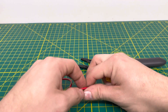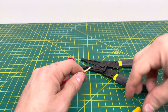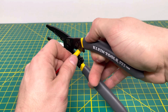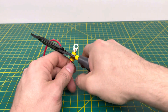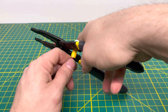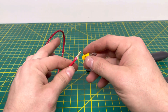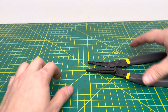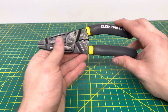Bringing in 12-gauge stranded wire with a terminal, we crimp down — though it seems like that crimp may have been messed up as well. The terminal is still pretty much on there, and it will crimp onto the wires if you do it correctly. For some reason, there was some struggle with that one.